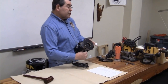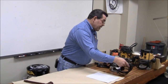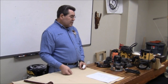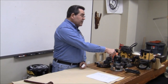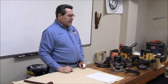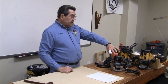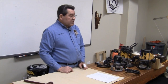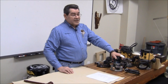The old Porter-Cable 690 was probably the industrial standard for contractors for many years. It had all the disadvantages you could imagine, but everybody owned at least one. They were virtually indestructible and easy to use, though the only power switch was on the motor, so you had to take your hand off the handles to turn it on and off. Single speed, no variable speed — unsophisticated but durable, and they're still around.